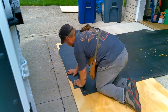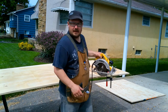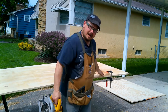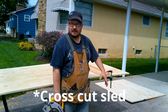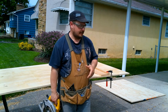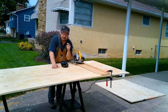The first part's easy. The first thing I'm going to do is run that straight line with my circular saw — it's going to be way easier and give me a way better line than with my jigsaw. I've got my circular saw fence and guide set up here. This is just a homemade guide; there are probably tutorials on YouTube about how to do one of these. Very simple to do and it'll make your cuts look great. I'm going to take this long four-foot cut first. And as always, eye protection and ear protection.